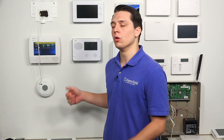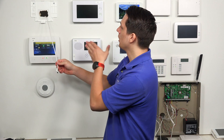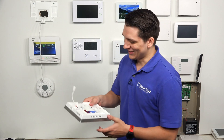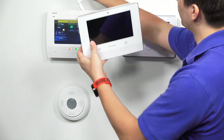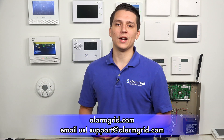As already explained, when mounting the Honeywell Lyric to the wall, run the cable through the back plate. I have already fished the cable through the wall. To plug in the Lyric and power it up — take the barrel plug on one end and the corresponding port on the back of the Lyric, plug it in, and mount it on the back plate — and you are good to go. That is how you run power to the Honeywell Lyric system. If you have any questions, contact us at support@alarmgrid.com or visit alarmgrid.com. If you found this video helpful, please like and subscribe, and click the bell icon for notifications. This is Jarrett with Alarm Grid — have a great day.